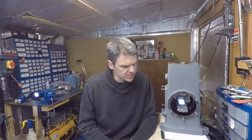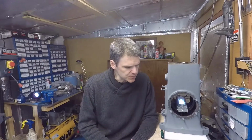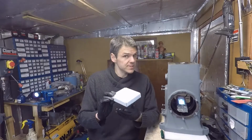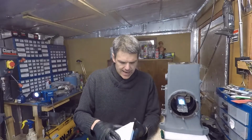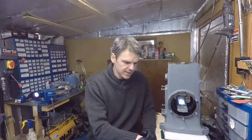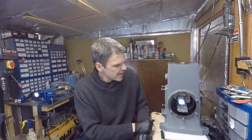Okay, so this is one of those videos where I say I've got good news, but I also have bad news. The good news is that I've got a brand new set of standard rings, just bought with the instructions, as you should. And I've shown you that I've done the honing of the cylinder. Now what I started doing is gapping the rings, as you would if you were building the engine.